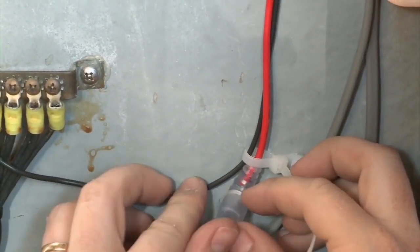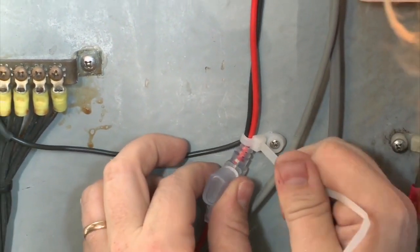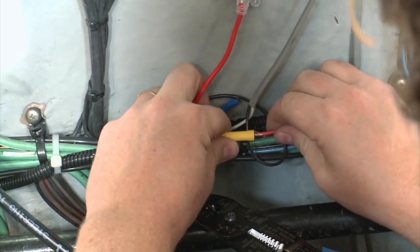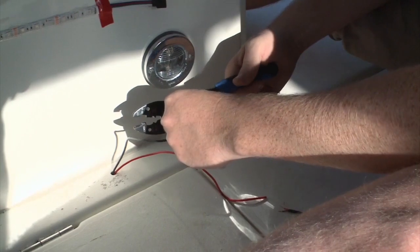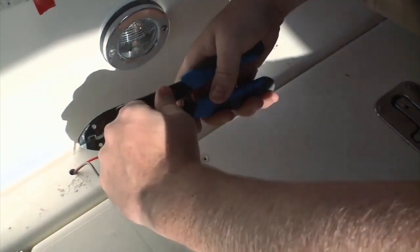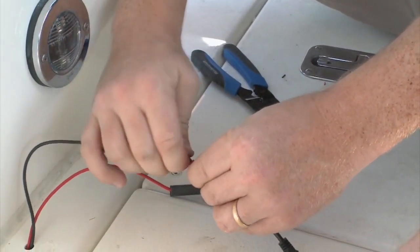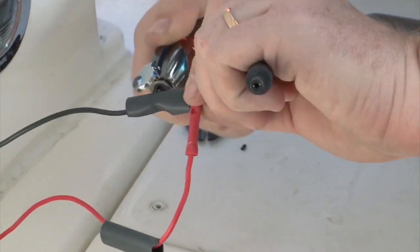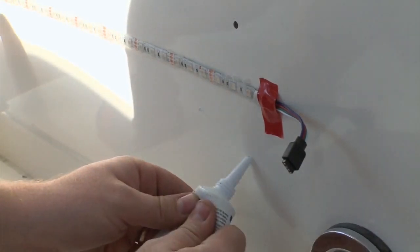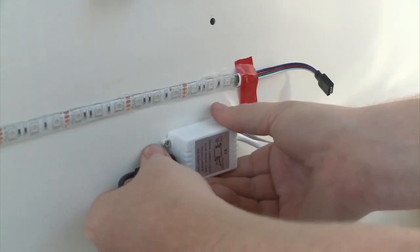To keep all the wires together and from flopping around, use screw-in zip ties with short screws — that's a big help. Use a connector to add the LED lights to the existing wires for the underwater lights, and it'll all be on the same existing switch. Now you have one final step: connecting the ground and power wires to the transformer. Strip the ends off all wires, then using connectors attach red to red and black to black, crimp it, and shrink tube it. Hold the transformer where you want, drill pilot holes, put some silicone over the holes to keep any water out, and then it's just two small screws to hold it in place.